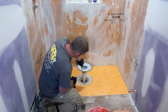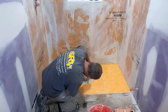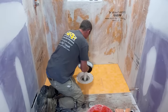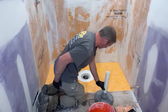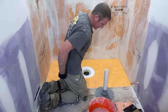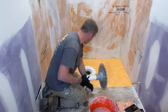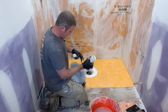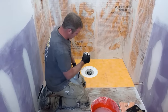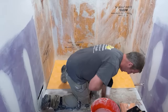But so anyways, we got 9 7/8. So I'm going to cut 9 7/8 off of this pipe. And honestly, it's going to be easier to cut outside the pipe. So you know what, I'm going to get a square cut on this first before I even measure. That's one thing I should have paid attention to, was whether this was square.